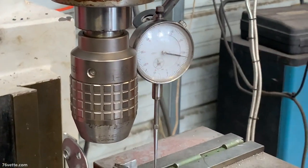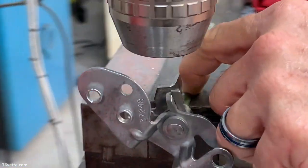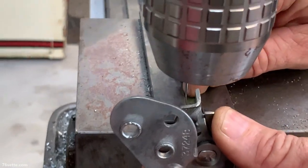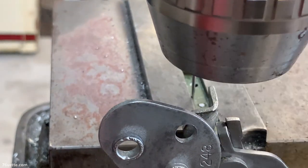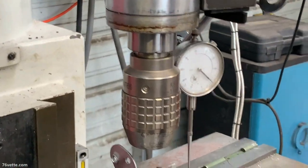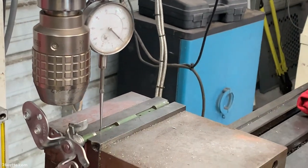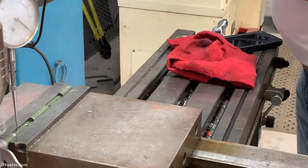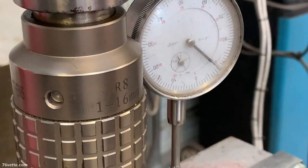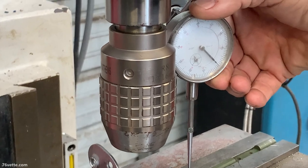I've got 17 thousandths — it's 17 thousandths lower in the back here than on the front. It's a bit harder because this thing is bent, but I can hold it down. I want to take about half of that, because every action has a reaction — if I'm raising this side, what I said was 17, so we're eight-and-a-half thousandths; this side's lowering eight-and-a-half because it's pivoting. Same as when you're dialing something in a lathe — you don't want to drill at an angle because that's when you'll ruin the threads. I don't think I moved it quite enough, but it should be a lot closer.